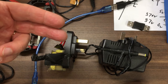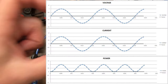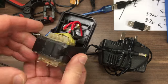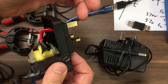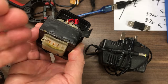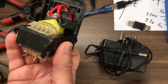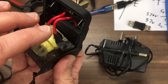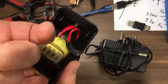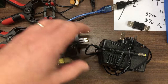It's really critical that the current being modified is completely synchronized to the AC mains voltage signal in your house. I started with one of those adapter transformers — the kind you'll have around the house — which takes 230 volts AC in the UK, steps it down through the transformer, and comes out as AC at the required voltage. The nice thing is it's synchronized to the mains voltage. Depending on which way around you connect it, it might be 180 degrees out, but that's fine — we can deal with that.